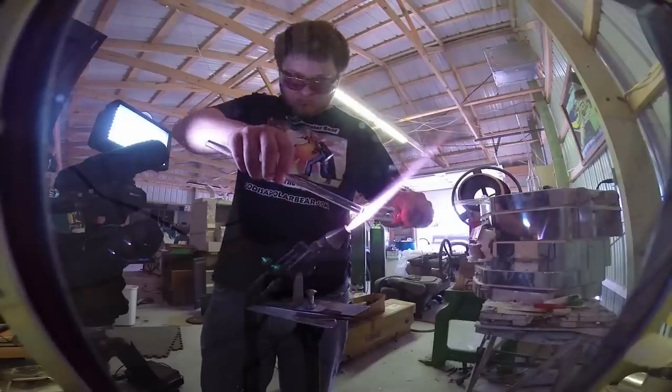And now we'll be learning how to tear a hole into the glass. We'll start by heating up a very small portion of the tube. Once the tube is heated, we attach the rod spinning very quickly in opposite directions. This will cause a very thin portion of the glass to appear and the flame will tear right through it. Then you just remove any excess glass and spin very fast and it will round itself back out for you.